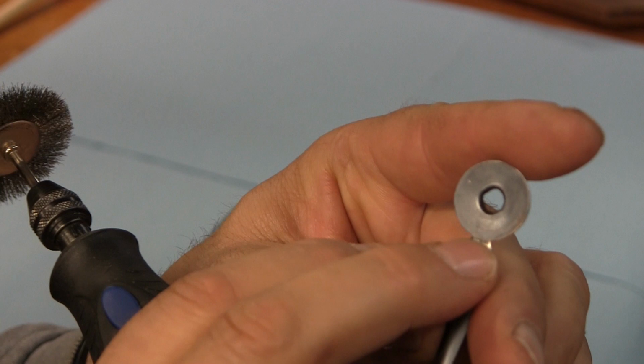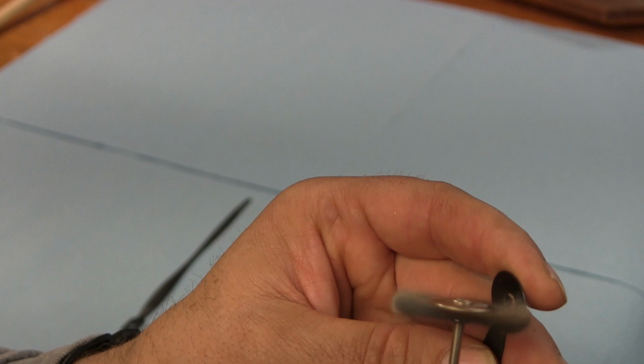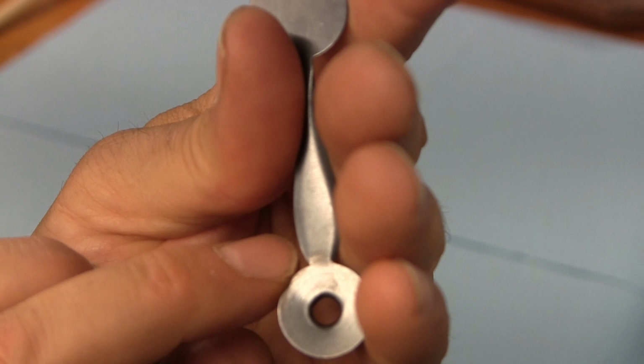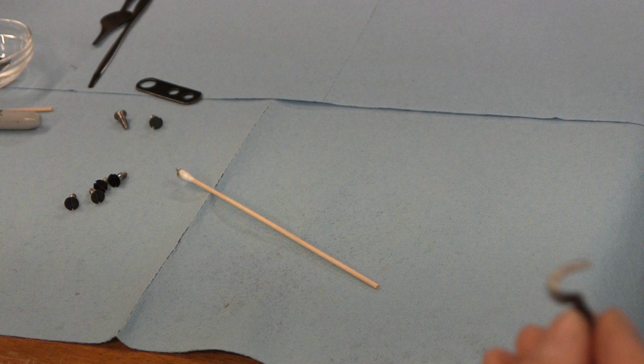The hands have just a little bit of rust right here. So I can hit it with the steel wool or the little Dremel tool on low power just to kind of clean that up. Okay, and now with the part that had rust and I touched up with the wire wheel to get it off, I don't know if you can see it very well, but I'll just take that bluing and hit that up, and that should be good for the hands. So all the little parts like that are finished.